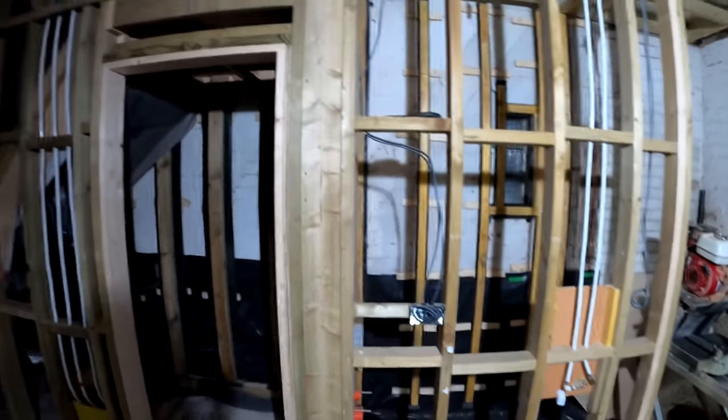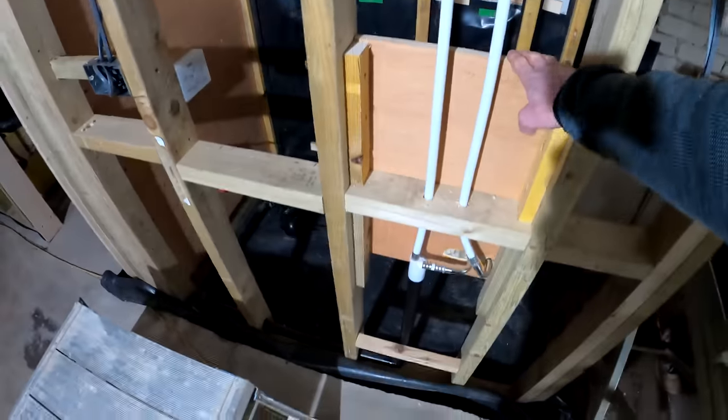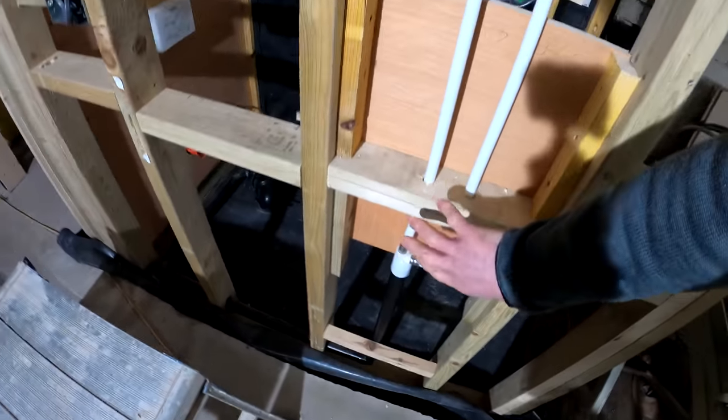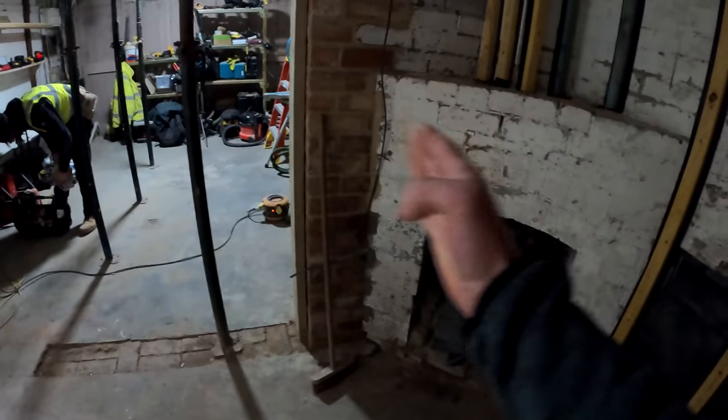Good morning guys, welcome to another day on site. From what it looks like, the sparkies have finished their first fix, so everything is ready in what will be the downstairs toilet. Plumbers are finished - got a patress in, got plumbing in for the sink, got a socket out here and a socket on there as well. We've also got the light installed in the cupboard. Liam has finished doing his brickwork - we've had to bring this wall out here just to take the pocket door, he's done a good job of that, all bricked in nicely, and that'll just be painted in with everything else. Battening is now finished all the way around, we've still got a bit of battening to do here, but we need to sort out this window thing. Upstairs is all good - looks like the first fix is done, apart from some lighting which needs to go here, so we'll have to have a word about that.